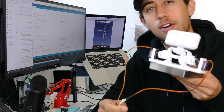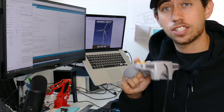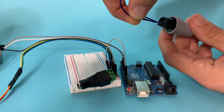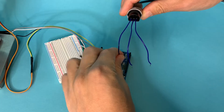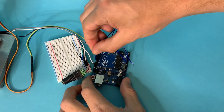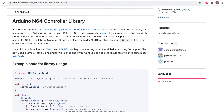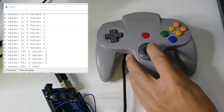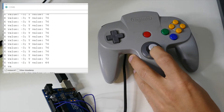Alright, the motors are plugged in, so now it's time to figure out how to connect the N64 controller to the Arduino — and as it turns out it's actually a lot easier than I was expecting. Step one is jam wires into the end of the controller cable and plug them into the Arduino. When looking at the controller plug from the front, the wiring is ground, signal, 3.3 volts. I have my code set up so the controller is connected to pin 12 on the Arduino. Step two is to install a pre-made library that allows the Arduino to interface with an N64 controller. With a few lines of code the serial monitor is spitting out the joystick X and Y values, which fall between minus 80 and 80.